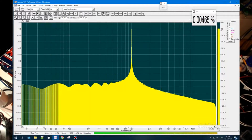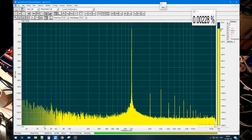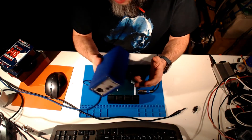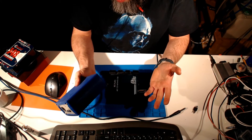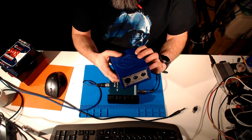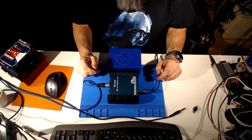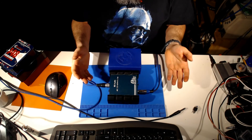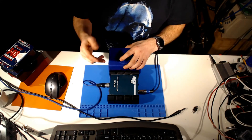Let's run the sine wave. Zero again. Distortion is 0.002%, but there is a big trail. I want to mention that those are hybrid DI boxes — active ones, which have an active electronic circuit and also include transformers. Maybe the transformers are offloaded, maybe it's the circuit. I would call those two friends twins, because they are pretty identical. So if you have an option to buy one for 100 and the other for 50, choose the cheaper one.